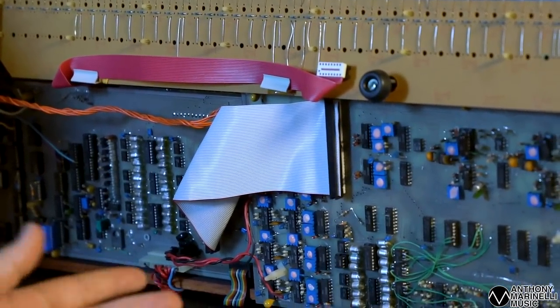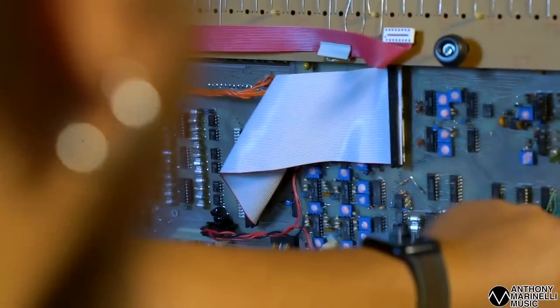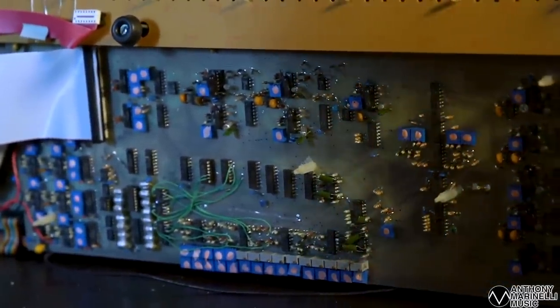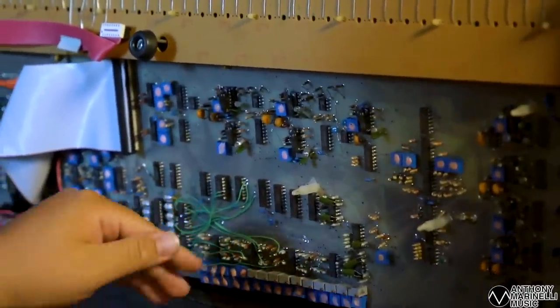This being a Rev 1, there's a second ribbon right here - you'll see nylon standoffs on the analog board because all of them had the ability to be turned into a Prophet 10, and that's how you would expand the voices. They discontinued that very early on because it's extremely unstable due to heat and the bottom board just gets totally baked. But they left all the hardware in it, and this being number 14, they definitely had the idea it could be a Prophet 10.